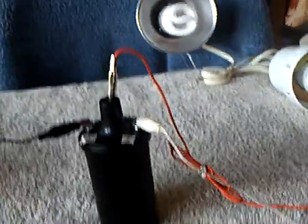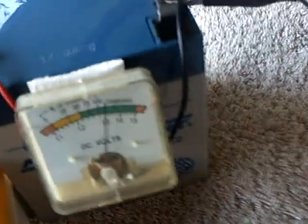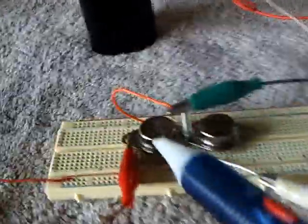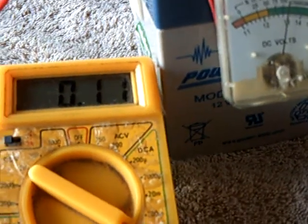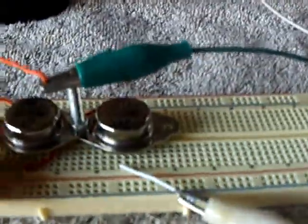Sometimes this self-starts and sometimes it doesn't. I've got it connected now — no power draw, voltage is there but everything is frozen. What Botkin found out is if you give it a little jolt to get the transistors into motion, the thing will run. I'm going to jump-start it — okay, there it goes, the lights are on. All I had to do is tap that right there. I'm drawing 110 milliamps and it does draw a little more this way, but it runs.